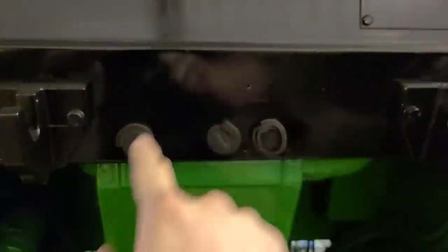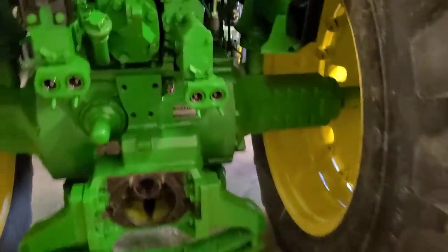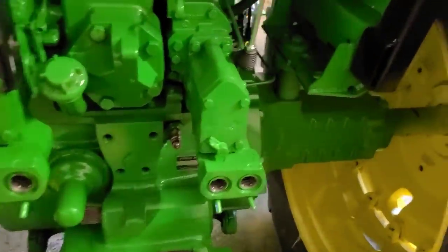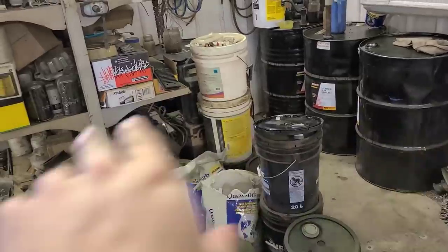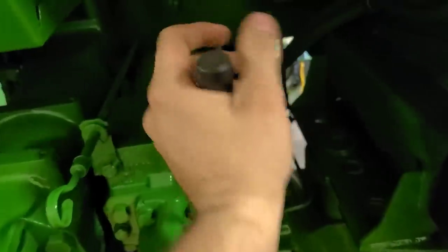And you'll never see that because the hazard sign goes back here. Oh yeah, that's the other thing too. They have a hydraulic swing on their auger, and they had a rope run in to the remote so they could run it from outside here to swing it in and out from under their semi. So instead of having a rope in there that wrecked this and all the stuff in the cab, we made them this little lever here so you can just run it from outside here.